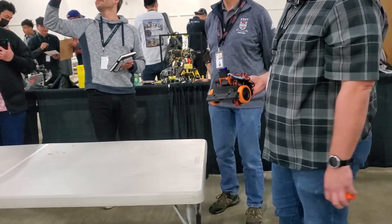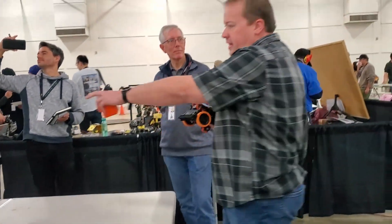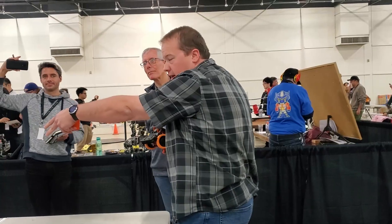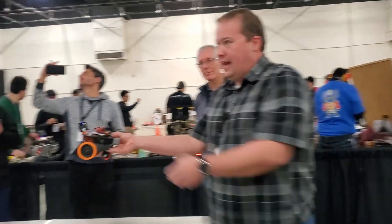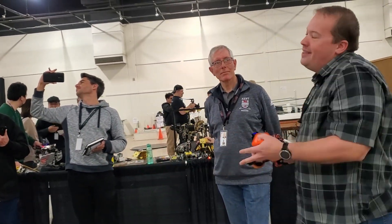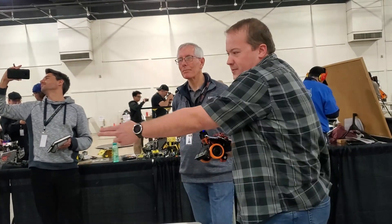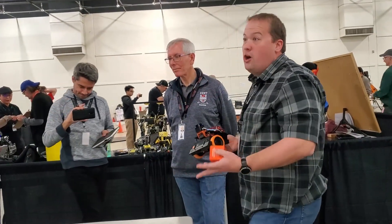The only thing that's measured through odometry is the 180-degree turn. What I am doing is accumulating my position in an XY grid — that's where you saw it's a little bit off to the side, so it starts to correct back. That control loop's not super well tuned, that's why it was kind of wandering, but it followed a line down the center pretty much.